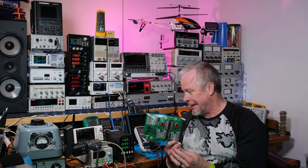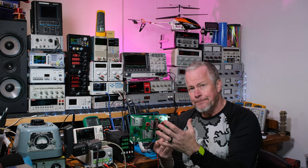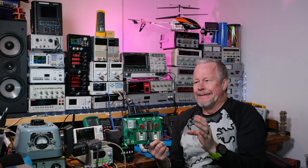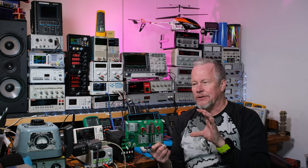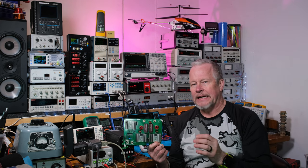Those power cord guys who think it makes a difference in audio — in the last video you might see how much the transformer and capacitors make a huge difference, and how little the power cord could make, if any. With something like this where you get regulated voltage out, the power cord and all that input circuitry is going to make even less of a difference.